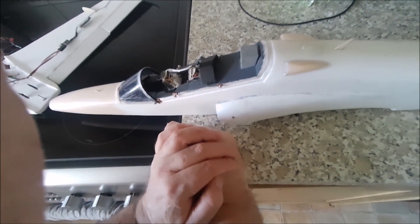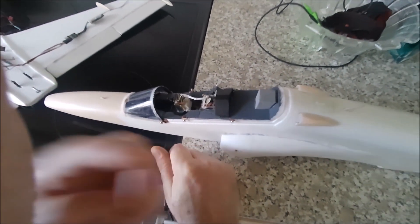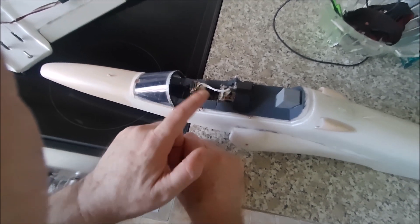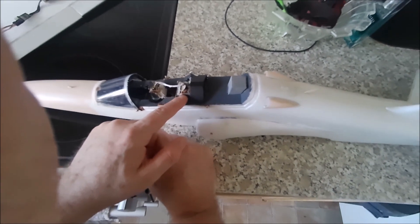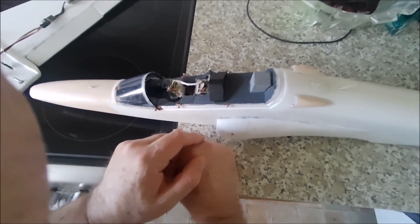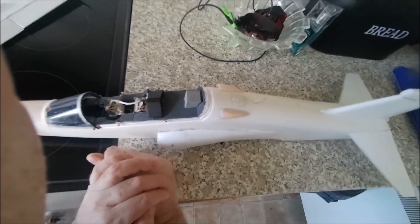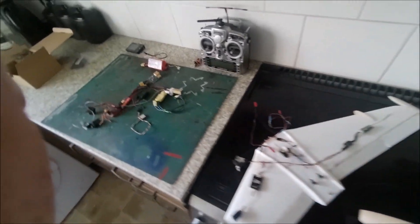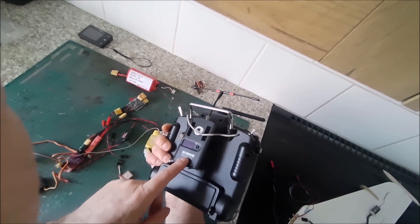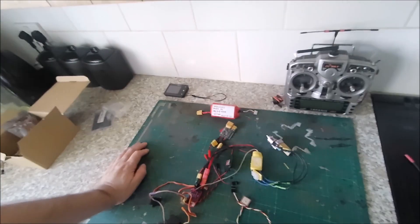There's a tiny little servo - about 12 by 14mm - which I found amongst my bits and pieces, and that's for the tilt. The other one underneath is the tiny one for the pan. This little camera is great - it's a Firefly Whoop camera with a 165 degree view. It runs into this board and you put an SD card in there - it records HD. I've made a little external switch so from the outside you can just turn the camera on and off. And this is my Crossfire module - we use it for longer range and it's just unbelievably good.